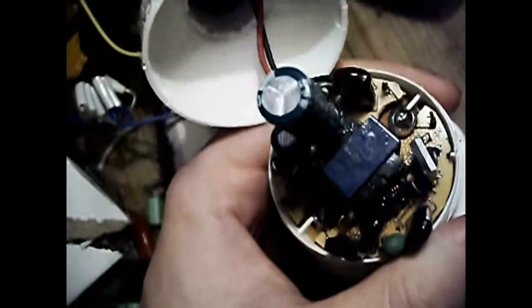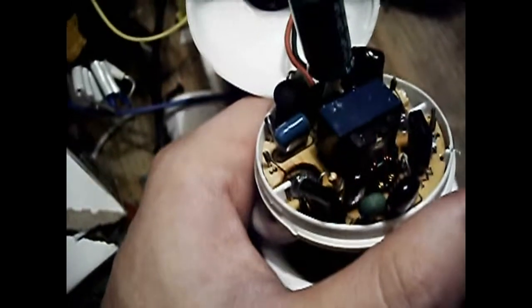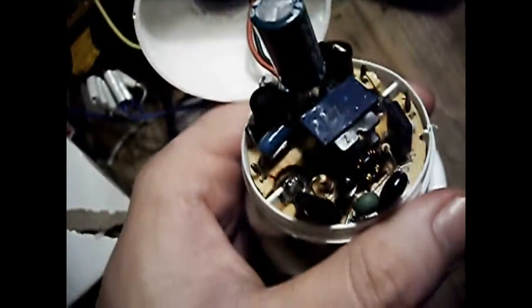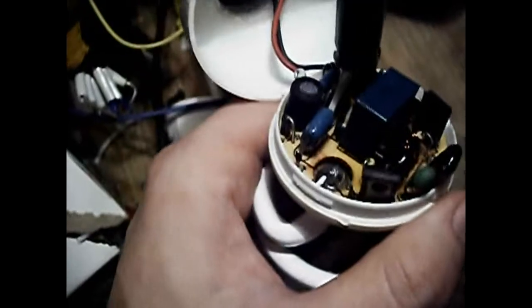That's why some lamps will glow at the ends for a few seconds before starting up. It's a bit better than instant start that lots of lamps use, because that really ablates off the emissive material on the electrodes. But lots of people want instant light because these things are being conflated with incandescent lamps, and games are being done to try and make these sort of eesh products behave like incandescents when they're not, and they shouldn't be used in a whole lot of applications where they're being used.